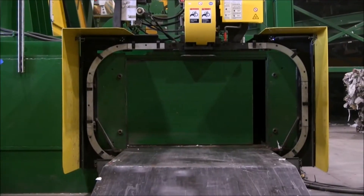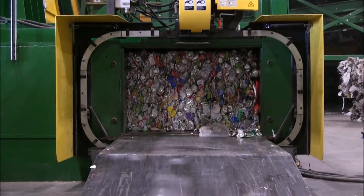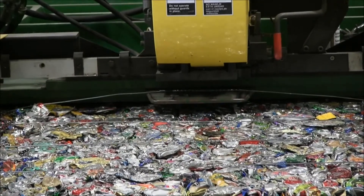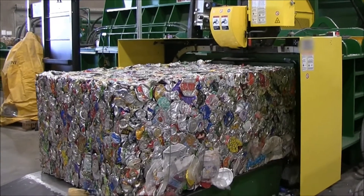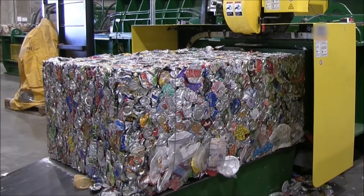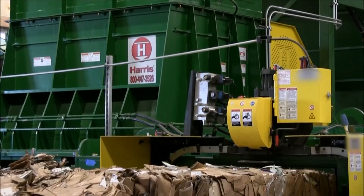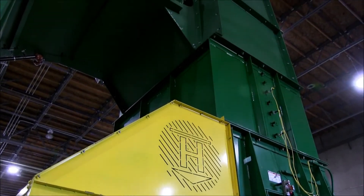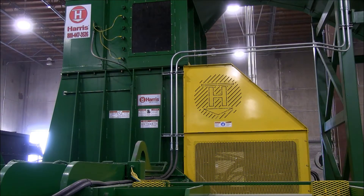In total, this would basically be like cutting through a tree trunk. That shearing action causes excessive wear on the floor. The liners in a Harris bail tie lid baler last up to twice as long as liners in a conventional 2-ram baler. With the lid balers, we have noted upwards of 18,000 to 22,000 hours and longer before a reline is required. With the pre-compression lid, the gathering ram just goes back and forth and there's no gouging. The liners, pumps, and valves last a lot longer because they're not being taxed by that sudden hydraulic shock from shearing.